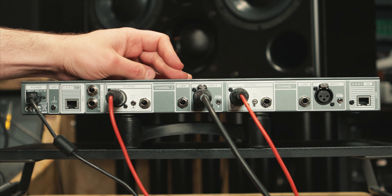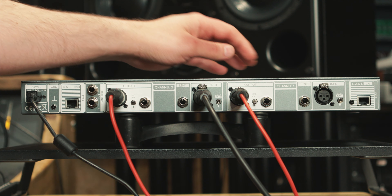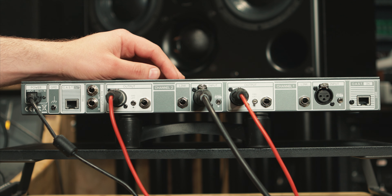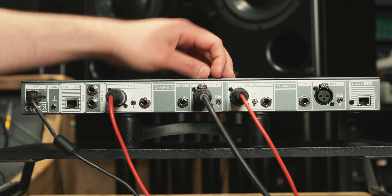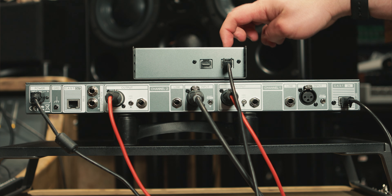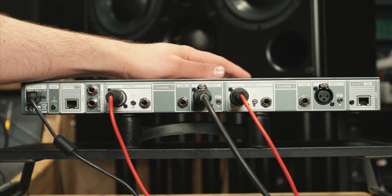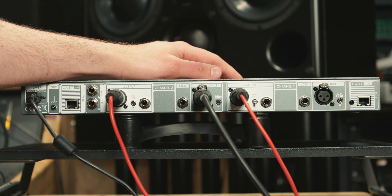The link system essentially turns this box into a re-amping box. So hypothetically if you wanted to record an electric guitar and you wanted the DI sound, you could come into the front of the unit on channel 1, take the link output into an amplifier, put a microphone in front of the amplifier, plug that microphone into input 2 — and voila, you record inputs 1 and 2 and have your DI sound and your amplified sound for flexibility later. On the input side we have an XLR input at the back and the cast input switch. Using either the N22 or N22H boxes it allows you to use those boxes as a stage box with just one Cat5 or Cat7 cable. You plug your microphones straight into that, so you don't have to have the EC2 inside the live room — if you're recording at home all you need is one Cat5 cable.